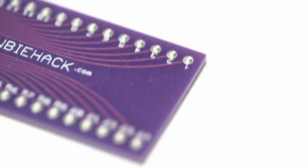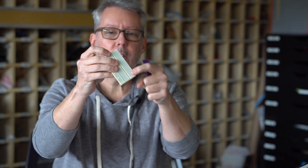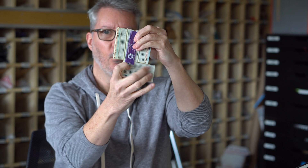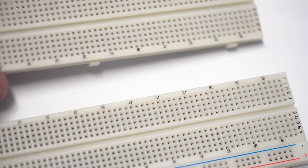There are alternative PCBs. This is the one that I sell on newbiehack.com. The reason I broke it out this way is because I'm using three breadboards. This particular breadboard only has 30 tie strips on one side — 30 plus 30 is 60 and I needed to break out the other four pins. So I designed it so it would plug in like this, one on each side and then another one on the bottom, and you can position this pretty much anywhere you wish to gain more real estate on one of the sides. There are alternatives that have 32 pins on each side, so you can use a breadboard that has many tie strips. Any of these alternatives I talk about I'll have links in the description so you can go right there and purchase it.